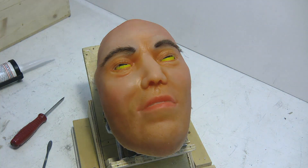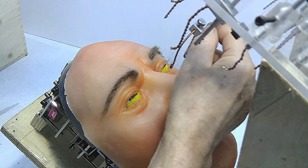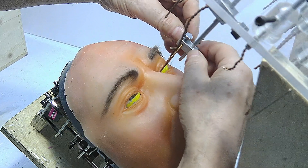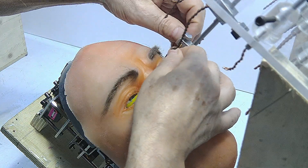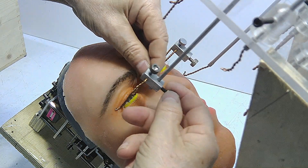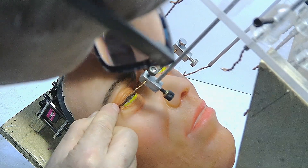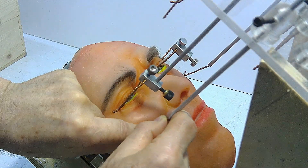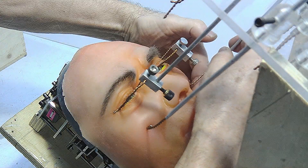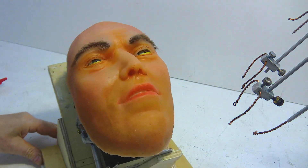The silicone in the cartridge takes several hours to cure, so do things with care. To make the eyelids adhere perfectly to the mechanics, we need a special device that uses pins to press on the sides of the eyelids so they adhere perfectly. The other pins serve various purposes including pressing on the mask to position it correctly. Wait six hours for the silicone to harden, or dry with a hairdryer — after two hours the silicone will have hardened.